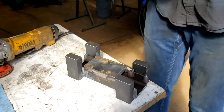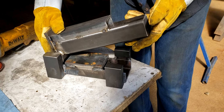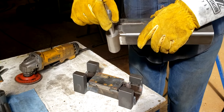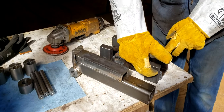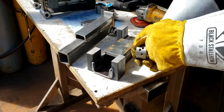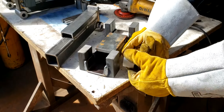This is the base and this is the pivot part, so this will go in here and pivot like this. My dad thinks it kind of looks like a tank. This pivot pin still fits even after welding, which is nice. This is going to get bored out, and there are also holes here that get bored out for the cam. The cam will sit right up in there, and this is the barrel that will set the different sizes. There will be a bolt in here, and as you rotate it there will be a plate and a bolt — it will hit the bolt and stop.